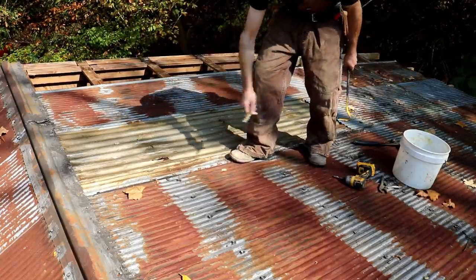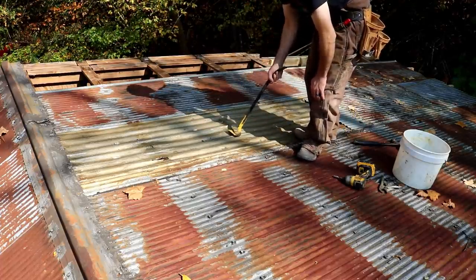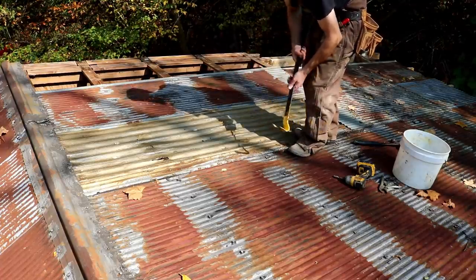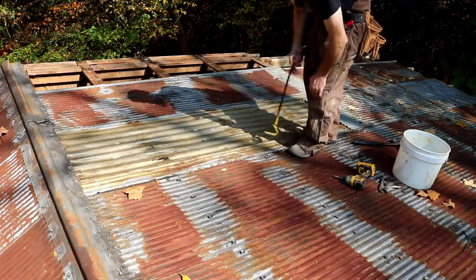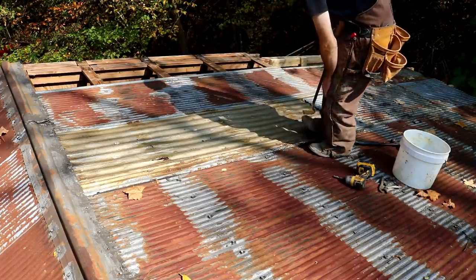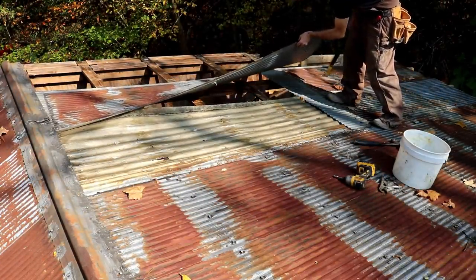It's fiberglass. And I assume that they painted this with some sort of leak-proof paint sealer to keep it from leaking. That didn't work, and then they stuck a piece of tin over it, and because that tin wasn't laid properly, it leaked around it. So these were a big source of my leaks. There's 8 of these on the roof. Well, the nails wouldn't hold much, would they?